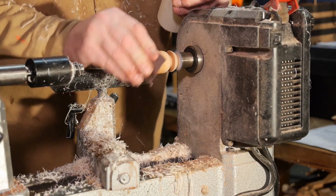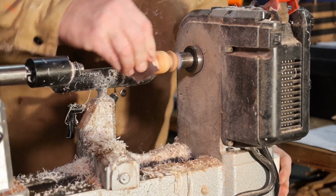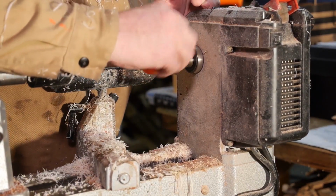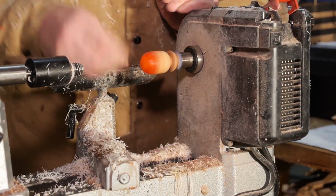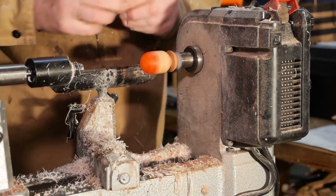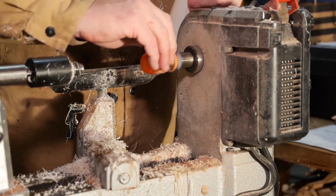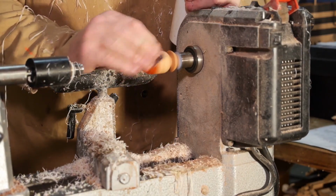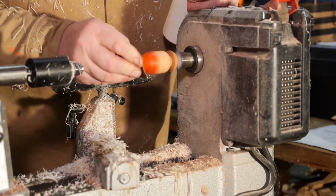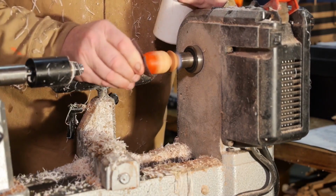Jump to 220. Still actually finishing up some shaping details. Alumilite as a material is very interesting. It sands pretty much at the same rate that wood does, and it behaves with sanding very much as wood does. So it's a good choice for the wood-plastic hybrids. Much better, I think, than acrylic, which is much more brittle than wood.